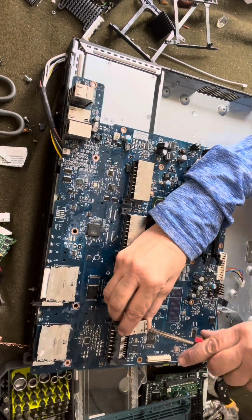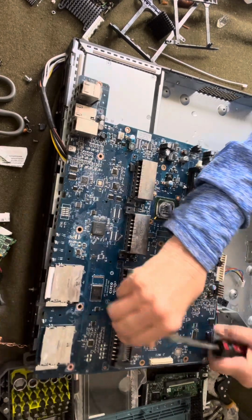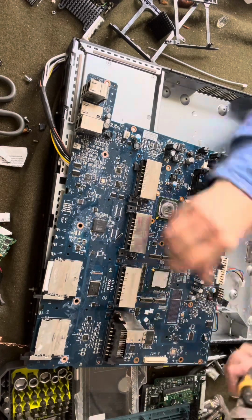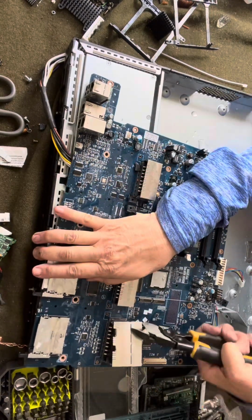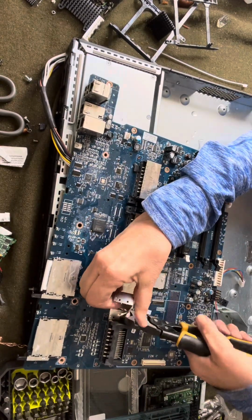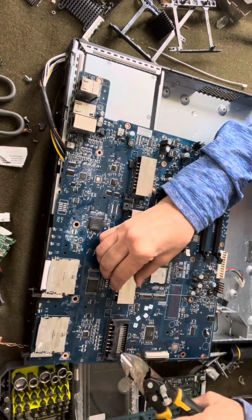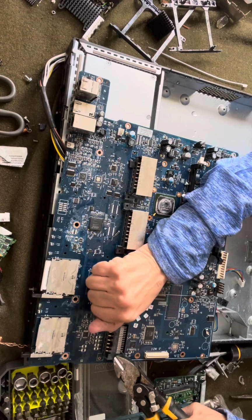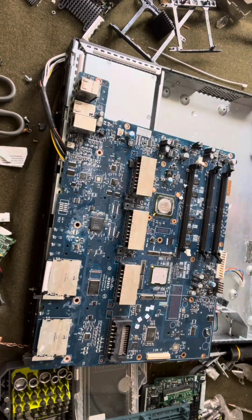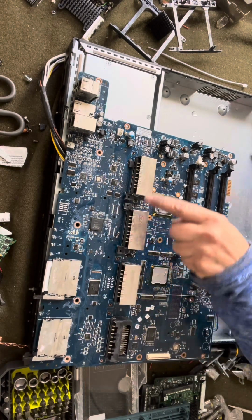This is really where you get a big differentiation on low-grade versus high-grade. Don't want to cut myself here. If your input-output jacks have a lot of visible gold, you can put it in as high-grade telecom. And these do. That's all gold in there. That's loaded. I know this one is, I know this one is, and I know this one is. I've already looked. This board can go as a high-grade telecom because these have lots of visible gold.